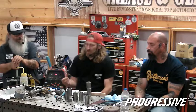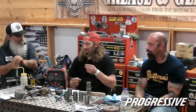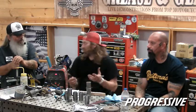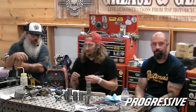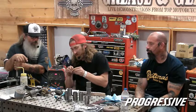And once you acetone it, don't grab it with your bare hands. Make sure you have a nice set of clean gloves set aside that you don't grind metal with or handle rusty mild steel with, because that gets put right on the outside of the rod. You can see right here, that's just from a rubber band, so that would get introduced into the weld.